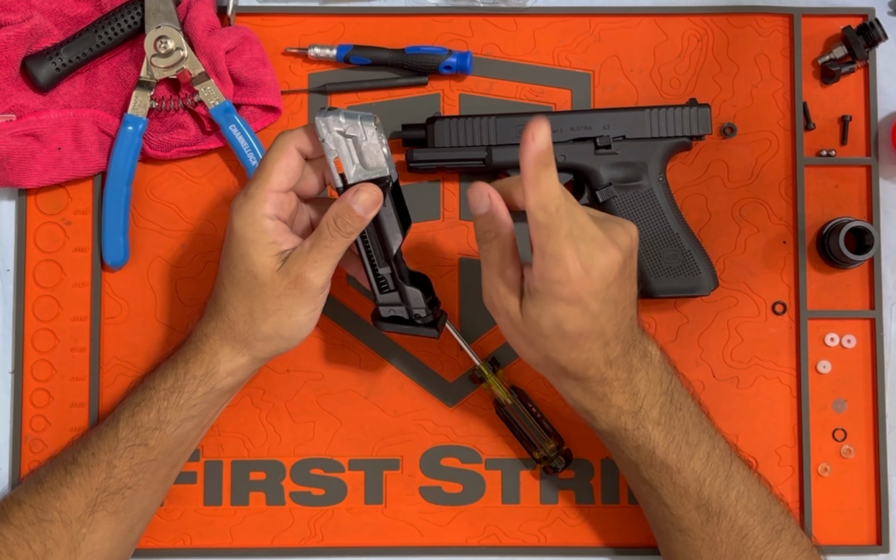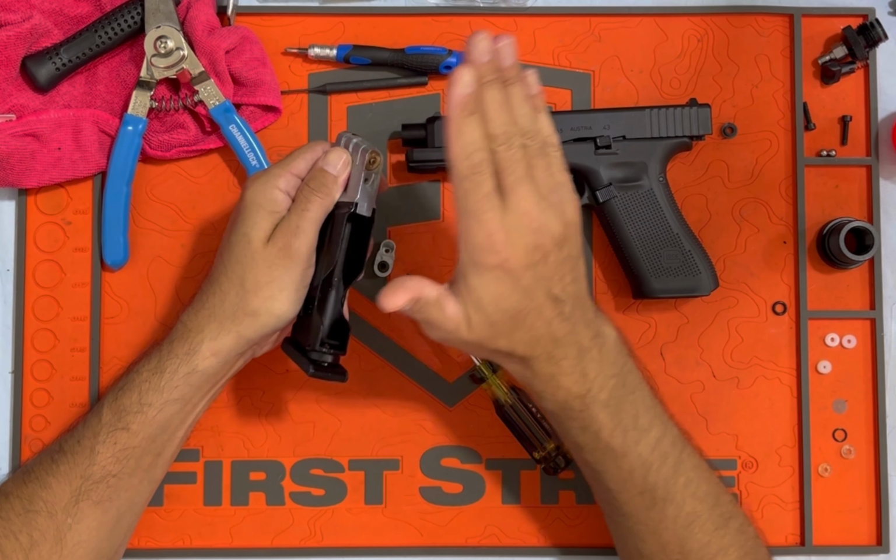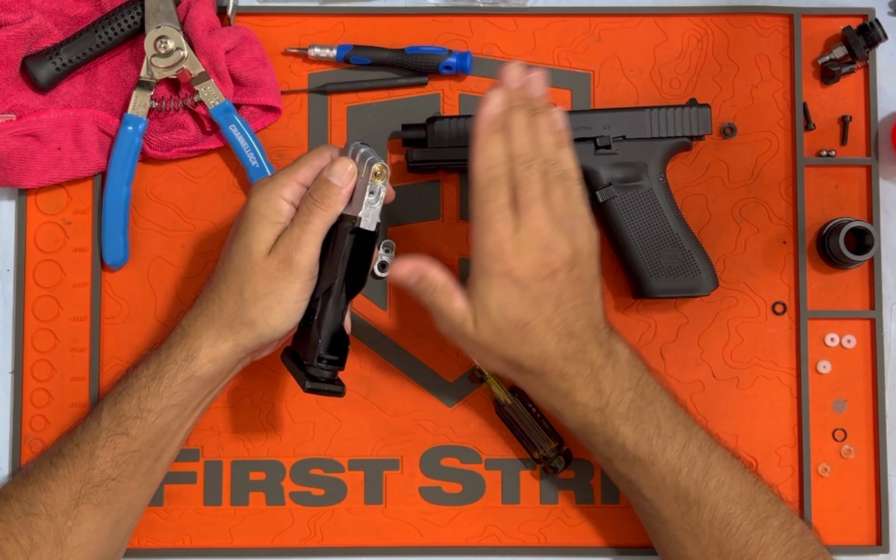So really the first thing I did was remove this back cap. I used my snap ring pliers to remove the valve, and I drilled using a 3/8 inch drill bit down inside this valve. It literally probably only shaved off 1 millimeter of material in here. But man, that is a very intricate process. I tried it by hand with a cordless drill at first, and it grabbed my mag and tossed it across the room. I thought I was done for, but luckily it only buggered up some of the threads for this valve cap. So it does still hold.